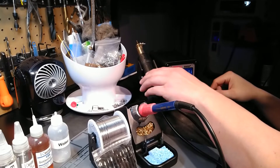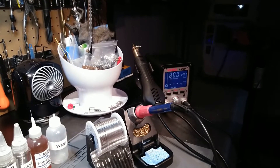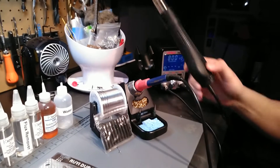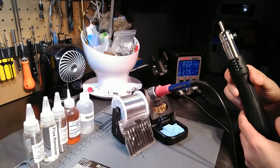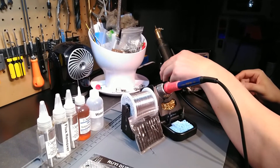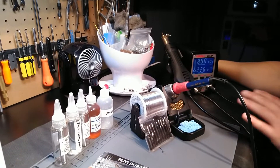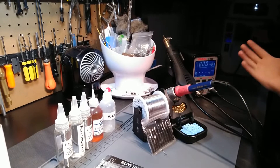The heat gun has the autonomous feature as well. I'll turn her on now — you can see I have her set at 375 degrees. No more burned parts. I do a lot of heat shrinking, and for guys doing SMD work you can set this all the way up. The knob on it is very simple to adjust — you can adjust your volume of air. As you lift this, she'll automatically turn on. The tips that come with the unit include four assorted tips. Once you're done, just place her back. You'll hear her accelerate the fan module up — that's so it can expel and cool itself down. Once it reaches its cooling temperature, it will turn itself automatically off. You've got three temperatures that you can preset, and you're all set.